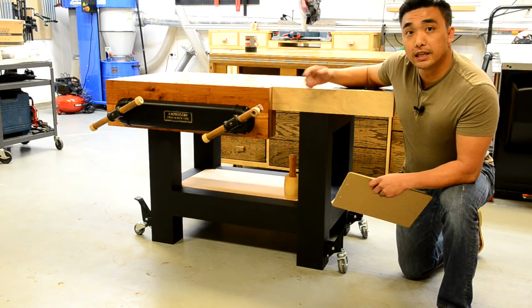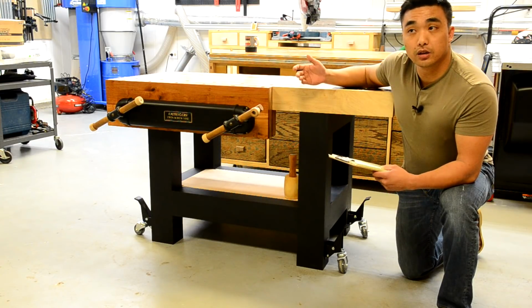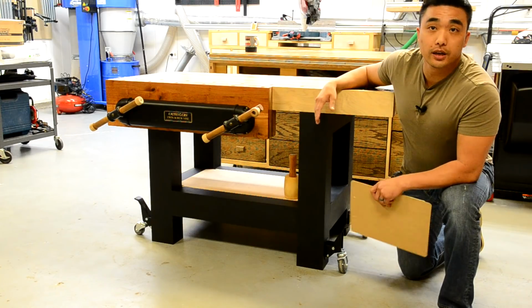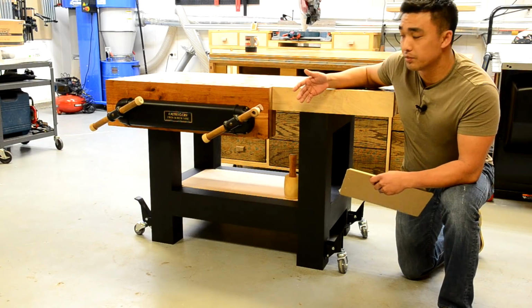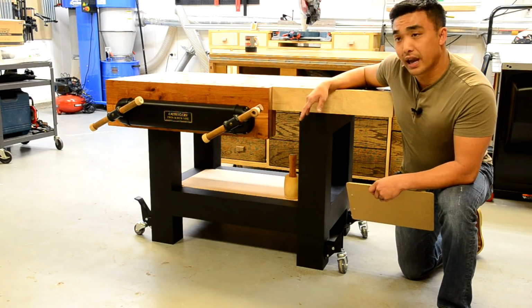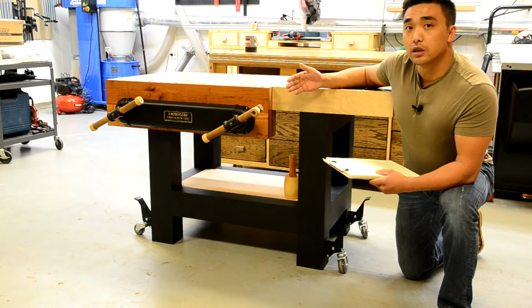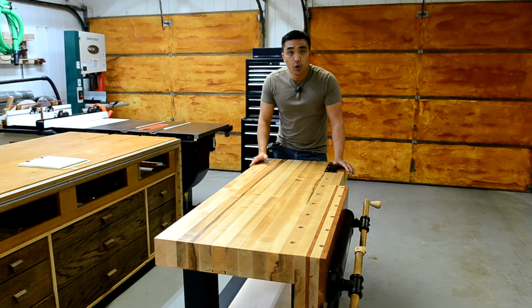But by all means, you can get spruce pine fir blend from Lowe's or Home Depot. But I recommend that you look in your area and see where your timber framers and construction companies are getting their lumber from. Total, I got about 8 of these 2x10 boards that were ripped in half to make the legs. 8 of those at 10 feet long. Total cost, about $33.